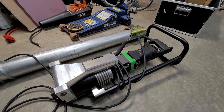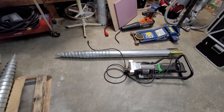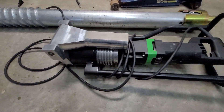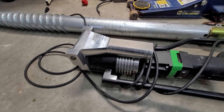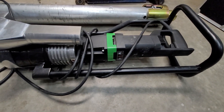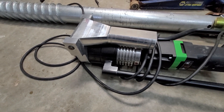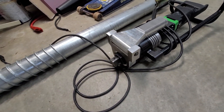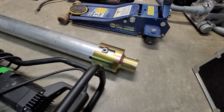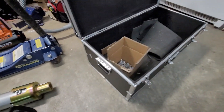Well hello everyone. Good day today to try to install these ground screws into the ground. We have a drill over here that is attached to this reducer to maximize the torque. This comes assembled and it looks like it's just a drill bit that goes down into this reducer, and this is what's supposed to install it. Then you have a big old socket wrench type adapter that goes on to the screws and this screws in, starting the assembly.